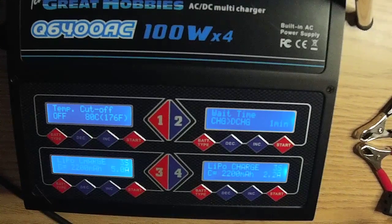Temperature cutoff requires additional cables which I did not purchase. I don't leave charging LiPos unattended and use my hand for temperature checks. If your LiPos get a little warm — similar to after a flight — that is okay. If they start to get hot or start puffing, remove them from the charger immediately and place them in a safe place. For battery disposal, contact the battery manufacturer.